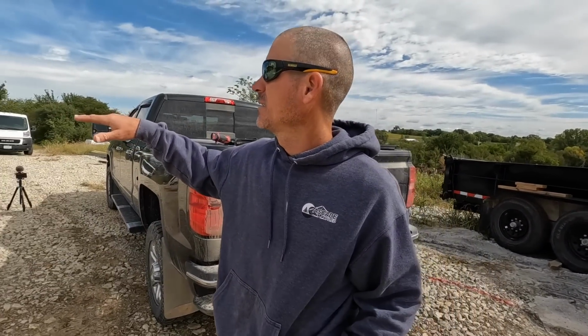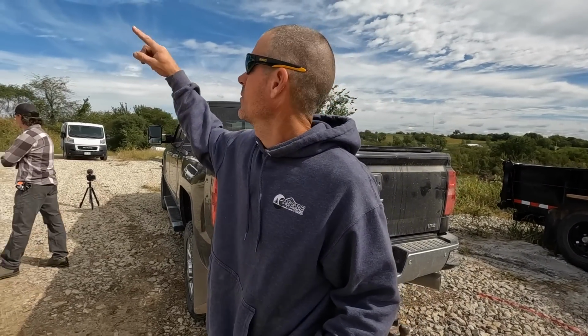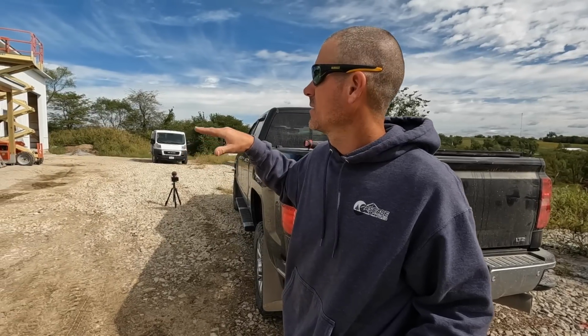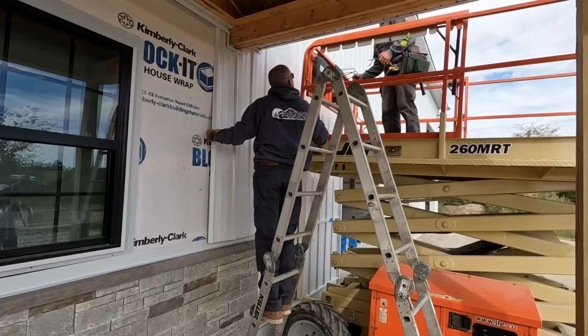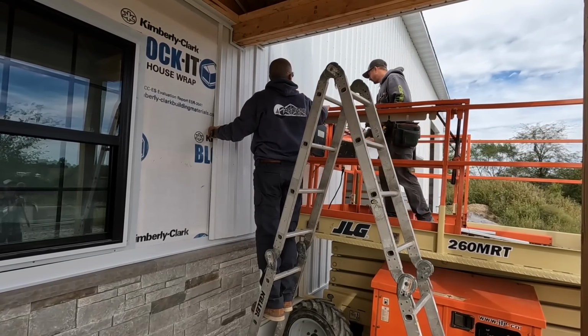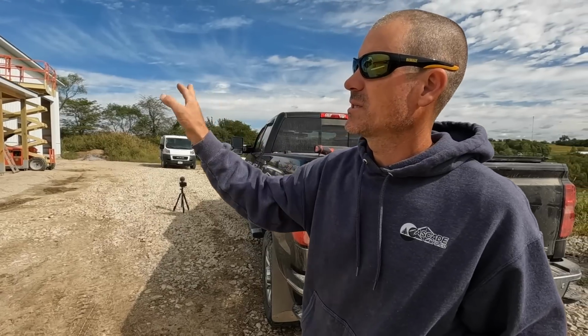Alright guys, so we added Versetta stone down here, and so the piece of steel that kind of went around the porch and down was cut to meet with 36-inch wainscoting. Versetta stone comes up about 2 inches short with a cap without having to cut one, so we're replacing that piece, and then we're going to put all the steel underneath the porch and wrap this steel up.